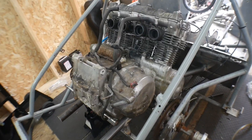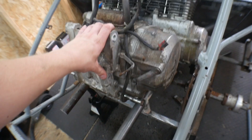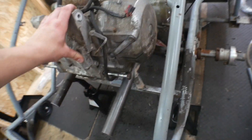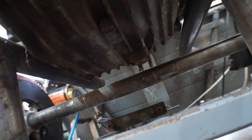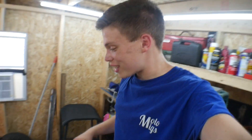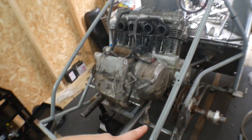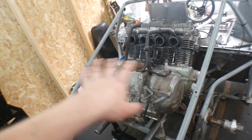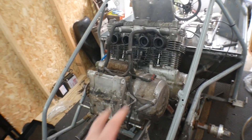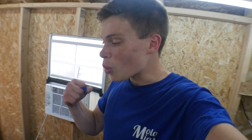The engine is now in and naturally it just wants to go forward because of all the weight of the head, but if I just lean it back, that is basically how it's going to be sitting. I have this thing pushed all the way back right now and the axle still clears it with no play. I am so happy on how the engine mounts are holding up — I just rocked this thing a ton of times by accident and they are holding up super good. I believe the body will fit over it once it's all mounted down.